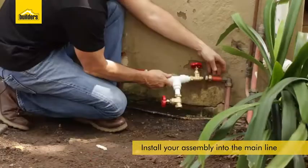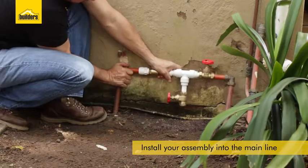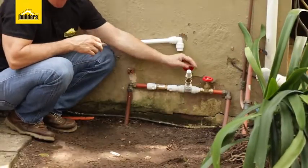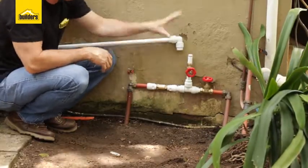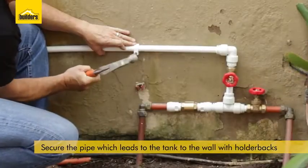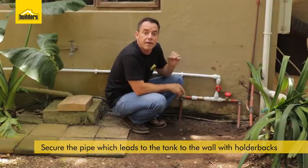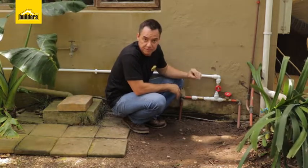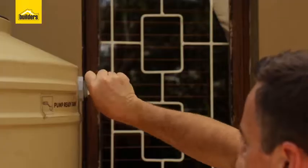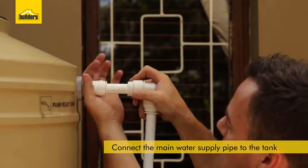You may get a little bit of residual water coming out of the pipe, but it won't be at any pressure so you shouldn't have to worry. My main connection is in, and the nice thing about these SpeedFit fittings is they can actually swivel and rotate. I'm going to connect my supply going to the tank onto the top here, and then I'll put in some holder clips just to hold the pipe secure in the wall. That's that part of the installation complete, and as you can see I've made it as easy as possible by making use of the SpeedFit fittings. I've also got the isolation valves in here to isolate the system whenever I need to. All I need to do now is connect up this pipe to the top of the tank with the same SpeedFit fittings.